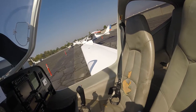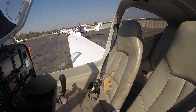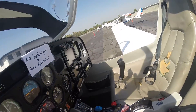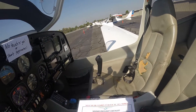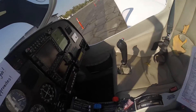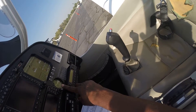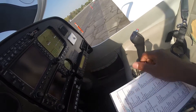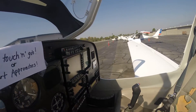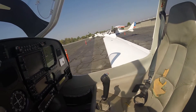We checked our stall detector. Now it says master switch, battery on. This is our master switch right here, so we're going to turn on the battery. That's basically just to check the fuel level in the aircraft. On the left tank we have 17 gallons, and on the right tank we have 13 gallons. Rule of thumb: if you have approximately 20 gallons combined, you're good for training purposes. Right now we've got about 30 gallons altogether, so we should be good to go.